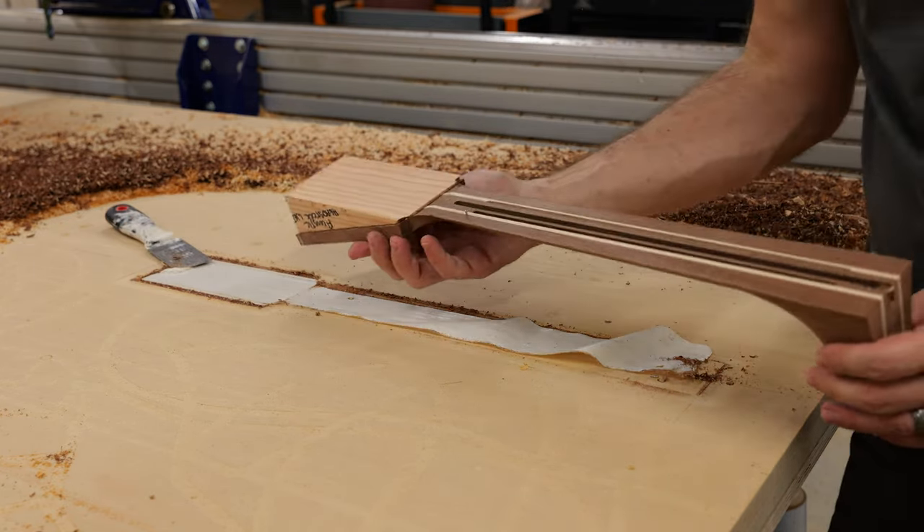A lot of the setup and playability of the guitar rides on cutting the neck joint correctly. Using a jig for the first time and only about a week away from delivery, I'm relieved that everything is right where it's supposed to be. On the opposite side of the jig, I establish the neck angle and cut the tenon where neck and body connect. Off camera, I installed two threaded inserts into the tenon so the neck and body can be bolted together.